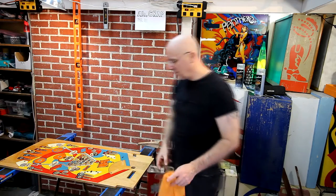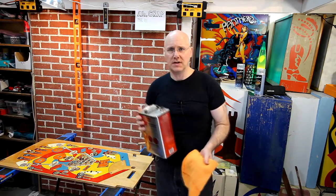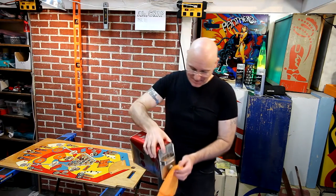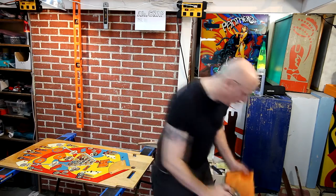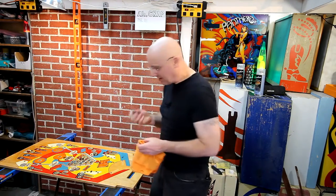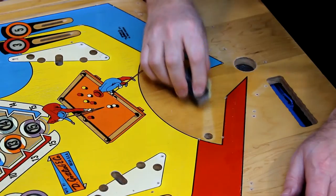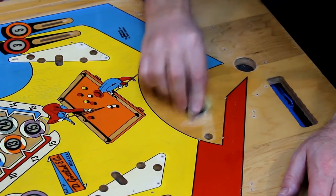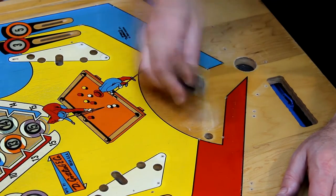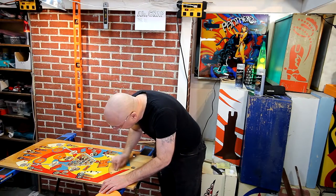So let's start by doing a little sanding. The first thing I'm going to do is — I don't have my little jar, so today's naphtha will be played by Coleman Camp Fuel. I'm going to put some naphtha on a rag so I can use it to wipe stuff off. This is 400 grit paper, just some scraps that I had. Let's see if we can get any movement on this and see if we can get it to change color at all. Normally I would use a block for sanding, but I think this will give me a little bit more control.